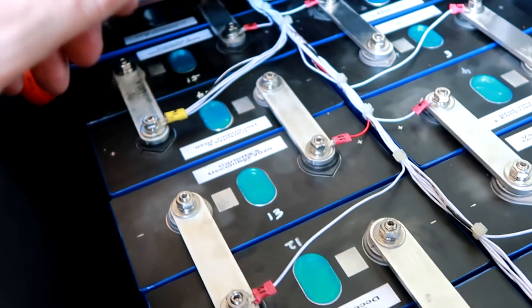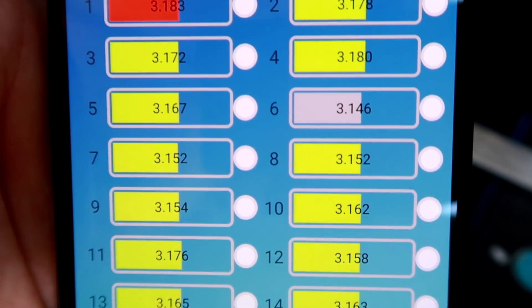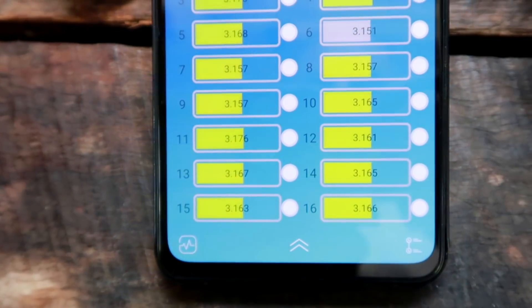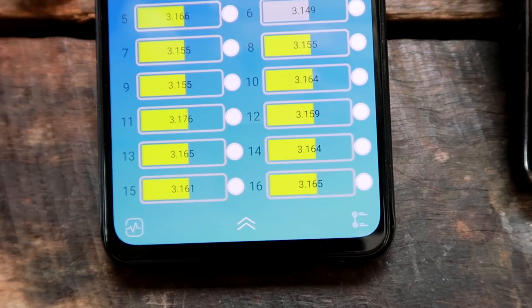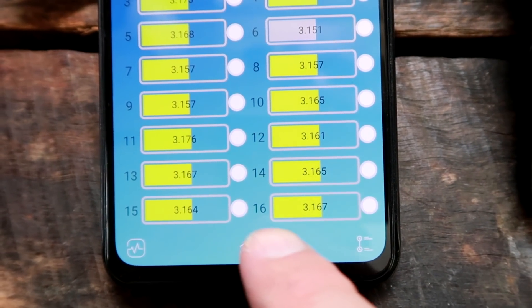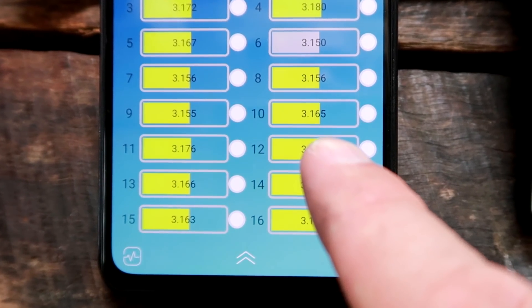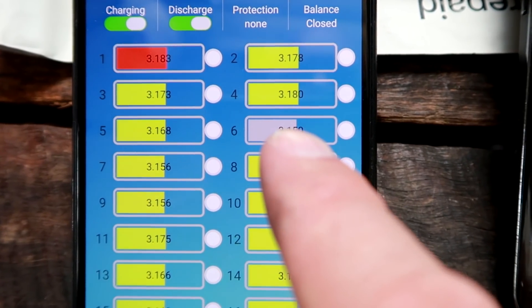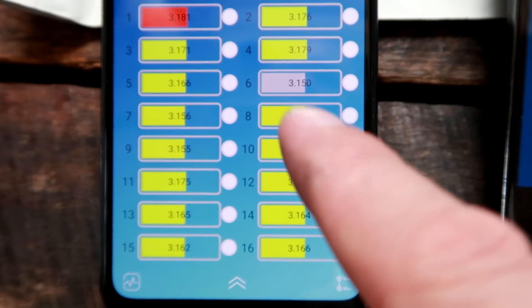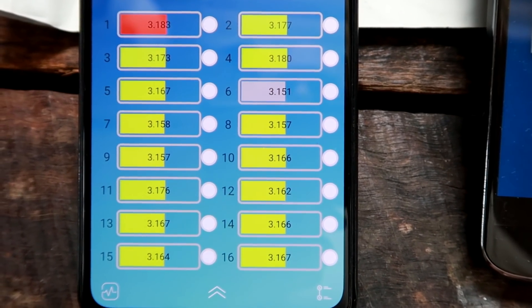This is all fine so far, apart from cell number six. But apart from that, all the other cells are in line - pretty much the same, in the mid-60s, mid-70s, 65. Cells 6, 7 and 8 are lower, and 1 to 4 are higher. So I think we've got a good combination they sent us - and nothing is really matched to each other.